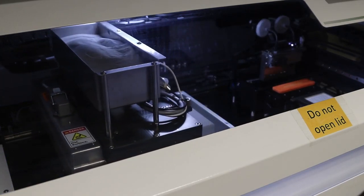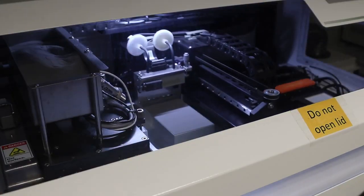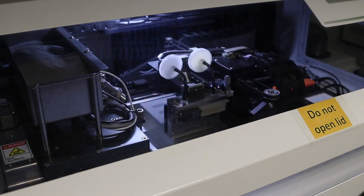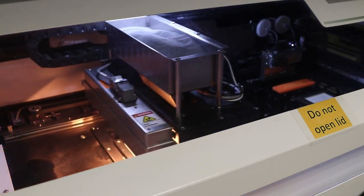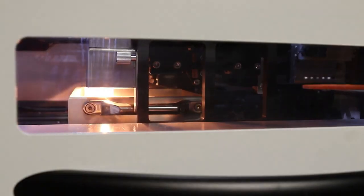The parts are built in a powder bed. First, a powder layer is spread over the entire building platform using a roller. In a second step, the printhead deposits the binder adhesive on top of the powder where required. These are the dark areas in the powder bed.